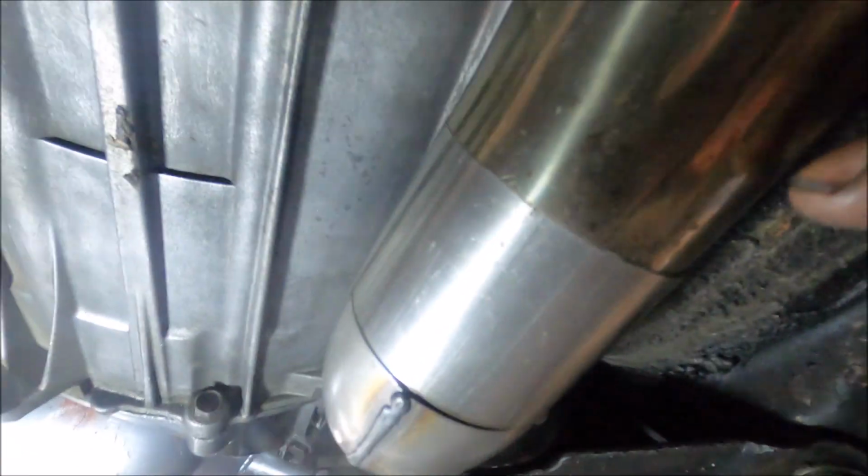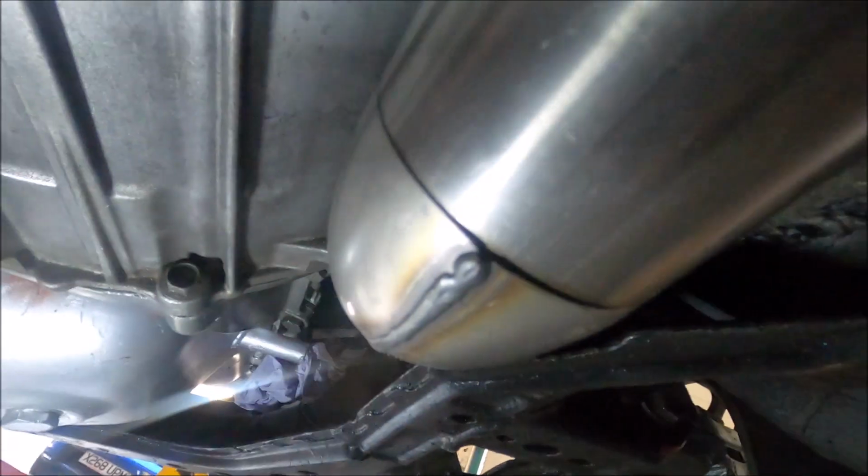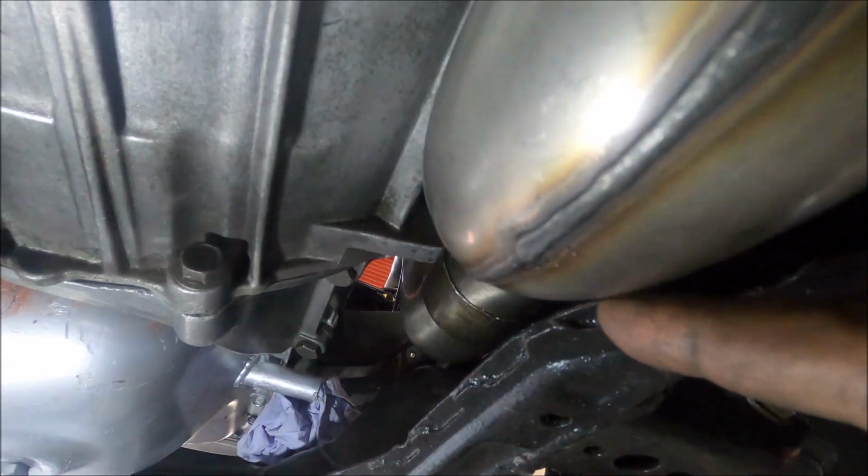And then here is another complicated bit, the gearbox crossmember. I worked out the bends for this, but if I have any more pipe than this to this bit, I can't get this section apart again, so it needs another joint. My first thought, because there's not much room, was a slip joint, but because the slip joint has to move backwards, there ain't even room for that.